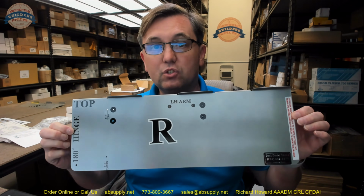And then if it's the first time that you're doing it, yeah, do a reality check. Look at the template, look at the closer. Make sure that JustDoorToolZ did this correctly. Of the ones that I've sold, I've never had a single concern that it was not accurate. Not at all. But, check the first one. If you're going to do 50 doors, check that. If you're going to do one door, check it.